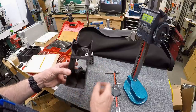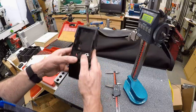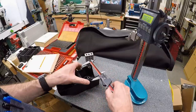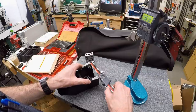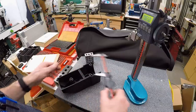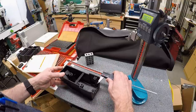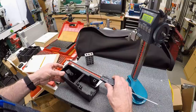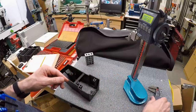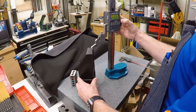We need the locations and sizes of the mounting holes so we can put similar geometry on the new part. Some measurements can be taken with calipers — the width is relatively straightforward at 88.4 millimeters, and below that we have parallel sides at 75.8. Getting the overall length is a little harder because of the draft — I have to hold this square with no reference, so it's much easier with the height gauge.